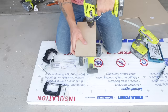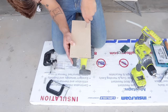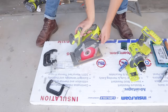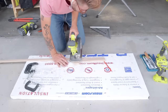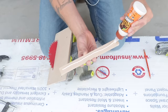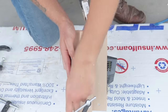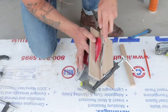After that I used a countersink to make sure that the heads of my machine screws would sit beneath the surface of the MDF so that everything sat nice and flat. After cutting the slot for the blade, I grabbed that one inch runner that I was using for a spacer earlier and cut them into the pieces that I'll be making the runners with on the base plate. Whenever you're attaching your runners, make sure and use the blade for your reference for square rather than the edges of your base plate. That way you know it's going to track straight and cut square. Notice the fit isn't so tight that I can't run the runner between the blade and the runner that I just clamped down.